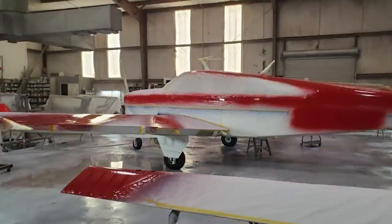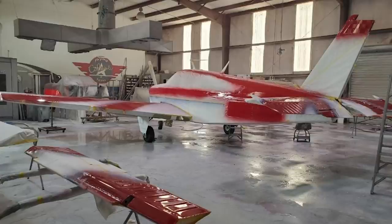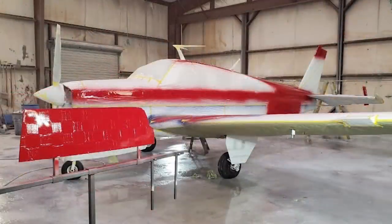That's where you'll notice on some of the cheaper paint jobs — they don't go to the detail, and you'll see jagged lines. You'll see flap coats that don't get painted, overspray up in the gear wells, things like that. The windows where the seam sealer is, we always have nice, clean, sharp lines — not rough tape. We use a special fine line tape for that to give you nice clean lines along your paint edges. When you shot primer on this just before it was dry, then you shot the white base coat — the primer we use is what they call wet on wet. All it has to do is flash off for about 20 minutes and then you can apply the top coat. It doesn't have to be sanded. It actually bites down into the metal. It's an etching primer, and that's where you get good adhesion.